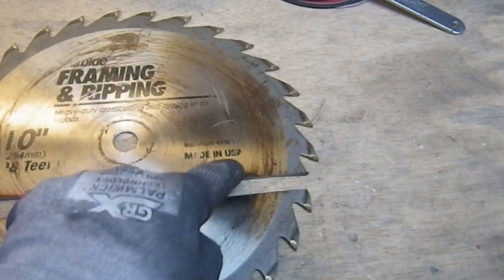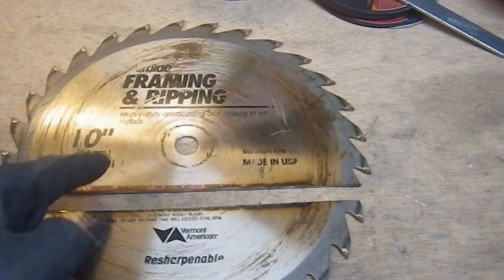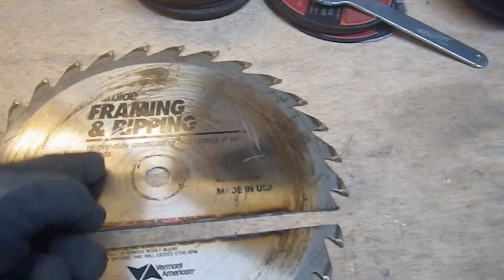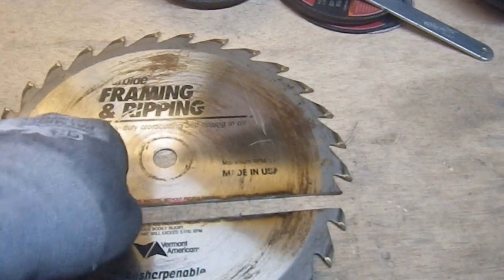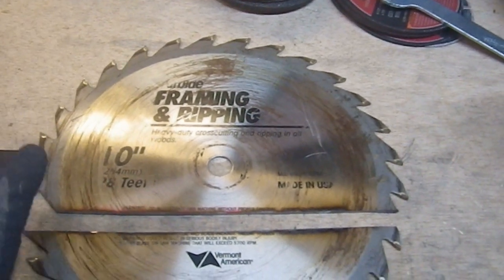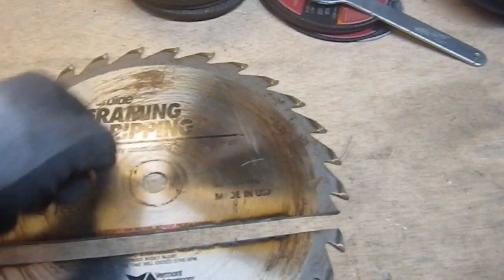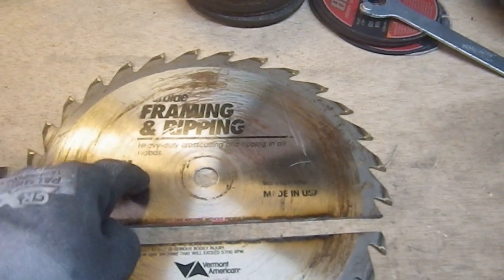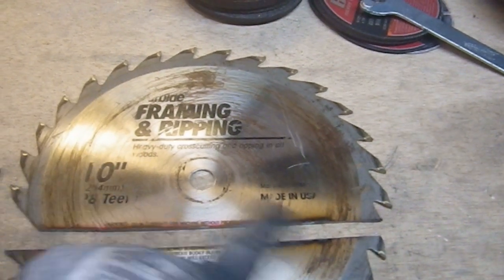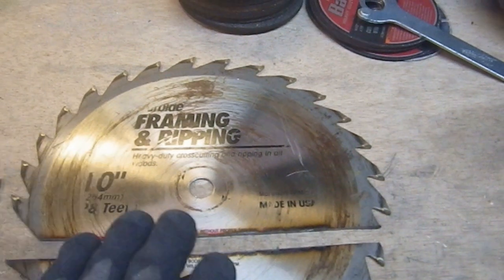So now I need to figure out what shape and outline that is, and then start working on that. That's probably going to be a process of taking some chunks off, like chunk, chunk, chunk, chunk with my angle grinder, and then coming in with the grinding wheel and finishing the shape out. In the past I've attempted the peck and cut method, where you peck holes and then you cut between them, but this is hardened steel, and drilling holes through this, even with carbide circle cutters, is a bear. It is easier to cut this by far with an angle grinder and then work on grinding it down later than trying to peck holes and then meet the holes up so the whole section drops out. It's just not worth it.